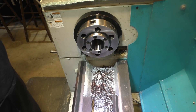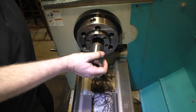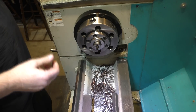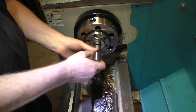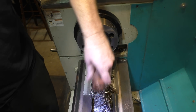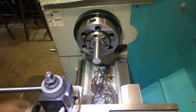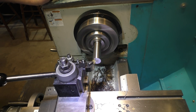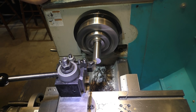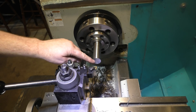An interesting thought occurred to me. Since I was mounting this on an MT4 holder anyway, my lathe came with an MT6 to MT4 adapter. So why not just turn it using the MT4 adapter itself? I made sure everything was very clean before seating it. Now you can't get any more on-axis than that. That looks good — we are faced off and should be square and perpendicular.